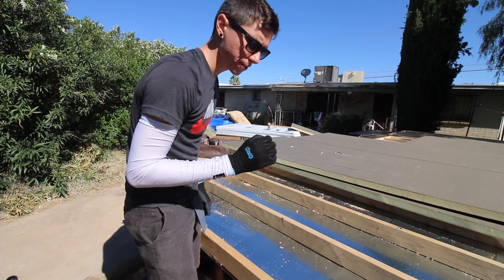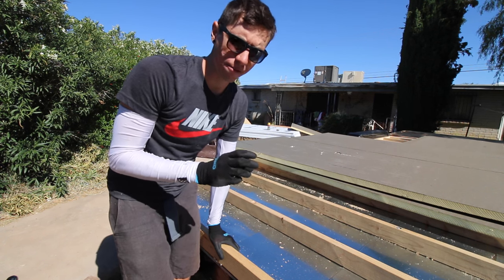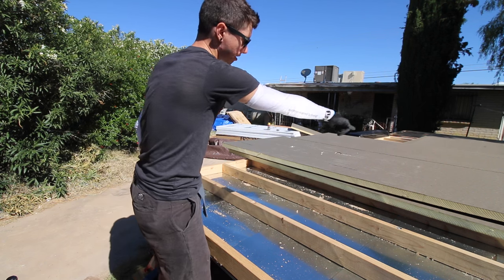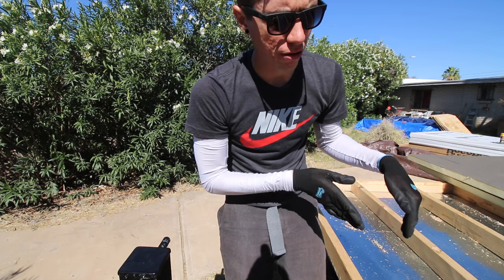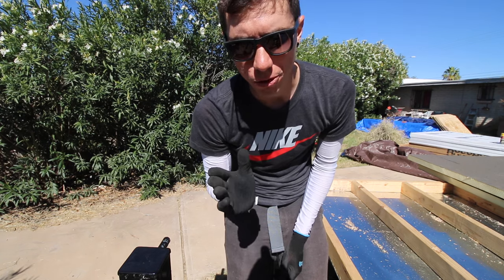What's really nice with this framing is that from end to end within the cavity it's about 7 foot 11, and these sheets are 8 feet long. So I can literally just cut strips along the long end and just drop them into place. Hopefully this will go by nice and smooth. I'm going to do a few sections of insulation first, then I'll show you how I'm doing it.